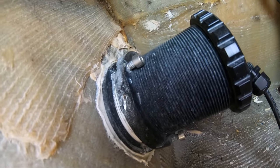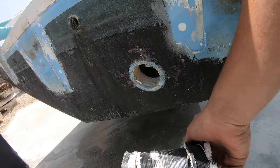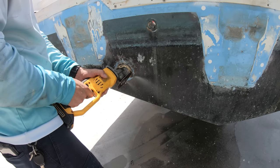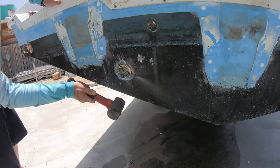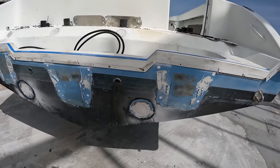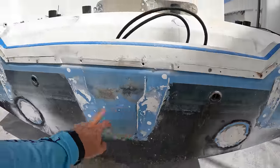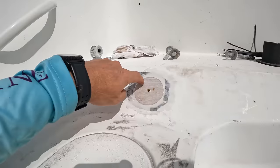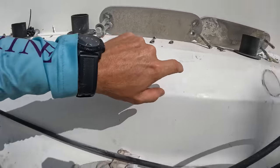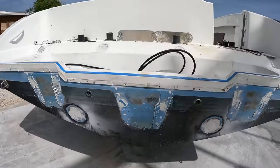As the standard goes, they were completely embedded in 5200 and did not want to come out. So we had to persuade them to come out by simply letting them know that we weren't here to rob them and that we didn't want their money. Then just like that, we have a completely empty transom leaving a perfectly suitable canvas for the fiberglass guy to come over and fill in all of these old holes. With that all taken care of, we can go ahead with the most crucial part of this project being the actual measuring and aligning of the engines and where to drill out the mounting bolt holes.